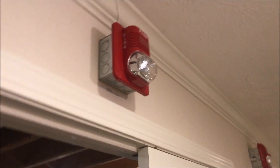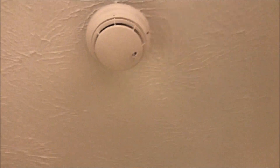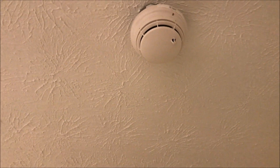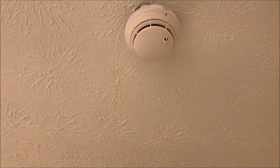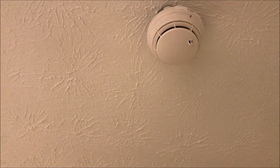I want the only horn sounding to be the L series so you can actually hear what it sounds like, because it's different from both the classic and the advanced, and I kind of like it. Same classic remote ceiling strobe, same smoke in here — we're not doing anything with that today. Up here is the same smoke-heat detector; we will be heat testing it today. It is set at 135 degrees because it is a smart heat detector — you can go into the panel and tweak the temperature you want it to trigger at.